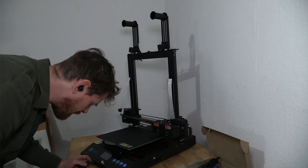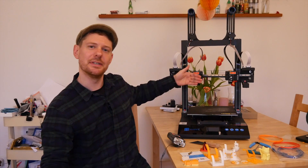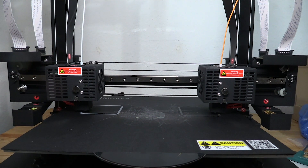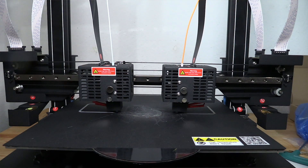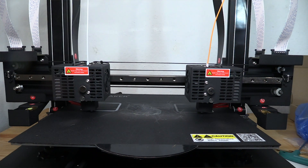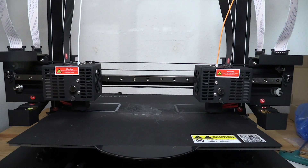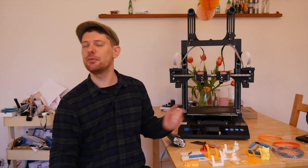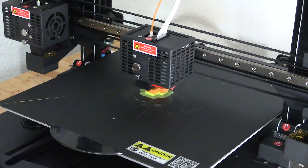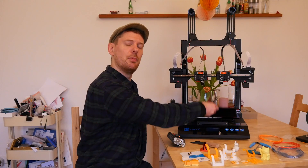The general frame of this printer is similar to most other 3D printers. The Z and Y axis are the same as normal — you have the build plate that moves up and down. Where it varies is in the X axis, because there are two extruders, so there are two belts driving them. Most IDEX printers are only actually independent in one axis, the X axis. That's why they're so good at tasks like duplicating and mirroring. The Z axis screws have a claimed accuracy of 0.001mm. The build area is 310x310x350mm, which is pretty generous, and the composite build plate is removable and magnetic.